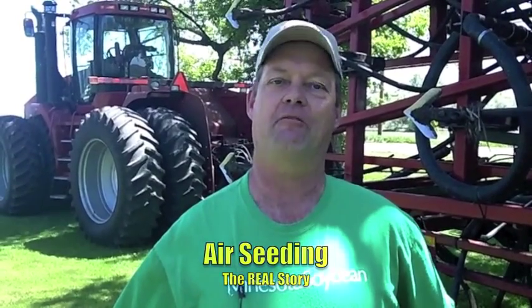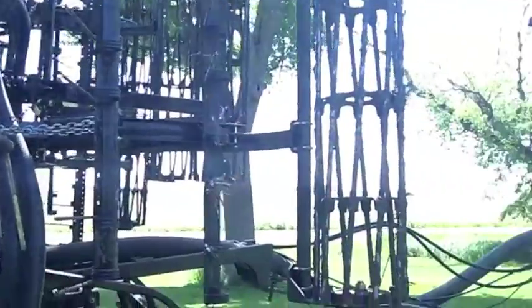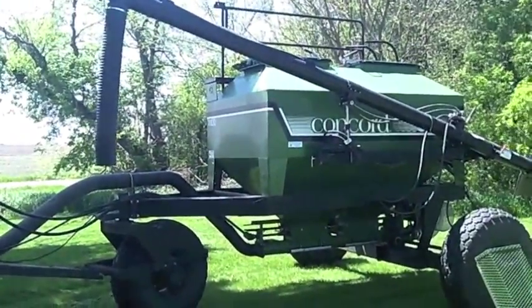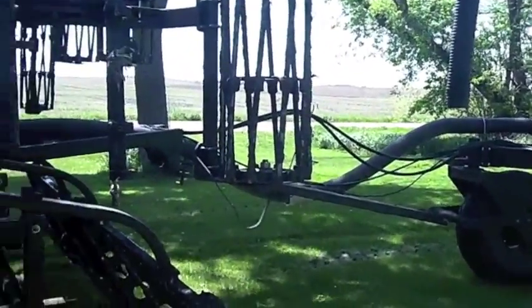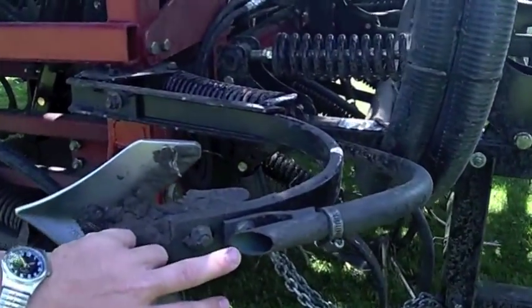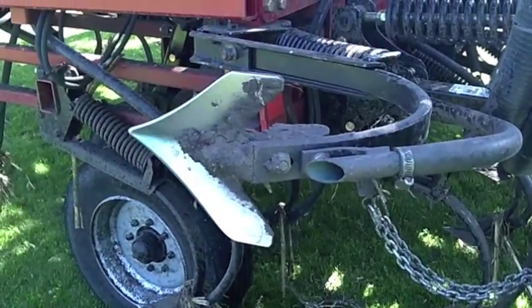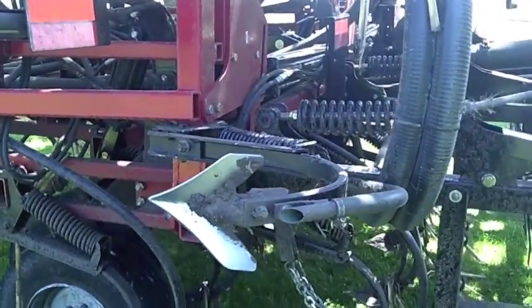As I mentioned earlier, I was out planting beans Thursday and Friday of this last week. I plant beans a little different than some people — I actually use what I call an air seeder. There's a blower behind it with the seed bins. The seed feeds through all these tubes and ends up behind all these shovels, which are spaced out six inches apart. It blows out through the hole and lays it in behind the shovel, so depending on how deep I want to go, it works out really nice — it's efficient, it's one shot and we're done.